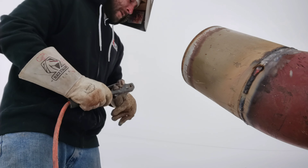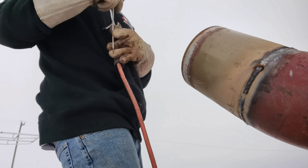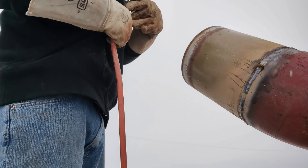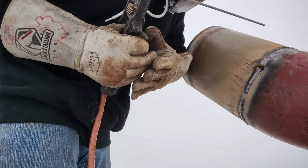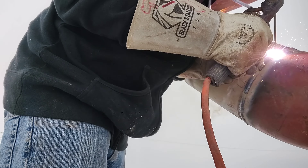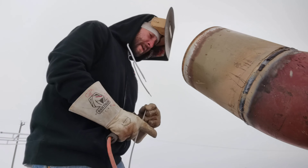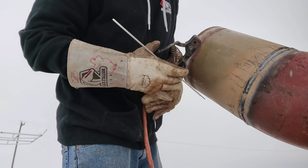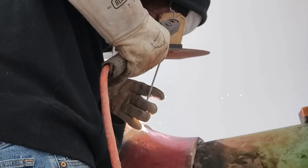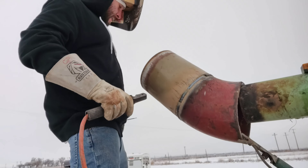I really need to get back out here welding more on this low-high. It don't look too bad though — I just had to cruise. Let me turn it back down to 40. Low-high mode's where it's at, plus I was coming across the top — that felt so much better. Oh yeah, it looks better too. And 40 is where it's at — definitely put it in uphill mode. About 107 amps is what I'm running. I really like that.